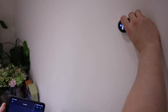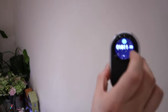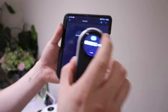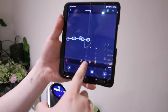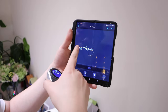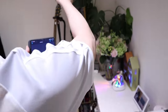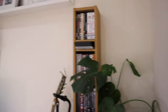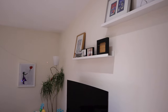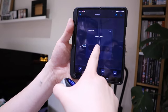Next, we're going to measure from here to that wall there. Can you see the red dot? I press the center of the screen and got 1.8 meters, then press Bluetooth. This is similar to the Leica workflow. Looking at the ceiling — it's slightly angled, so I use the app to adjust it. I'll go with my gut feeling and move it, unlock and lock. The next one is perpendicular to this wall — I press X, see the red dot reaching there, press the button, and got 4.1 meters. I press Bluetooth again and it's imported.